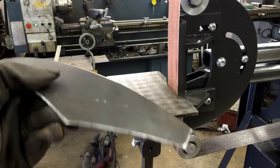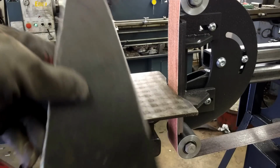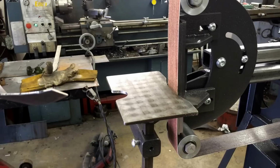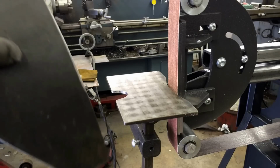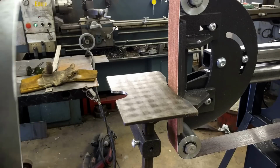Okay, we got it ring rolled and plasma cut. I just took the plate, laid it up in the wheel, and transferred it. Now I'm going to deburr it a little more and fit it to the rim. I'll use the belt grinder and proceed on with that.